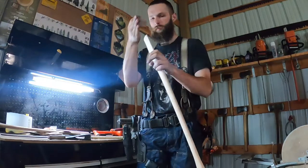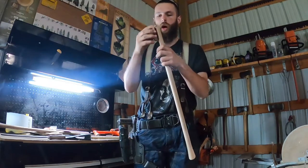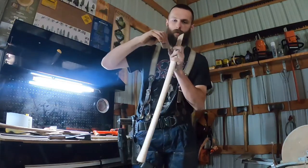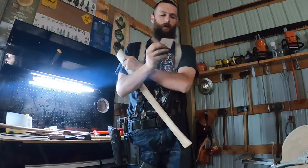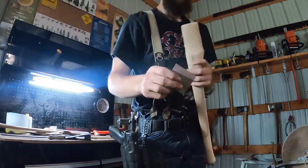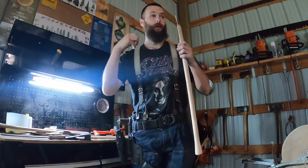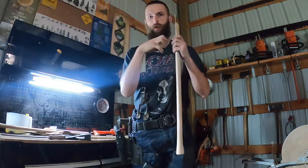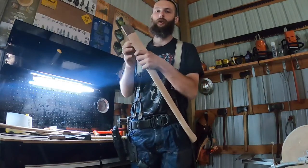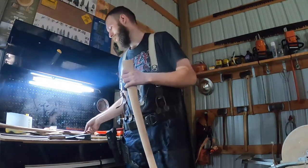However, when you are cutting the kerf, when you're trying to figure out how deep you want to make it, don't go all the way down, because not only are we talking about, again, fibers compressing to where we can compress these fibers down and scrunch this a little bit, but also the edge of this wedge is pretty sharp. So what'll happen once that bottoms out, not only is it going to scrunch, but it is going to, I shouldn't say break, but it is going to deform, I guess is a better way of putting it, a lawyerly way of putting it. It's going to deform and kind of round out and flatten out on that bottom to fill in the gaps. Again, hopefully I'm making sense with all this.